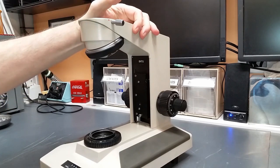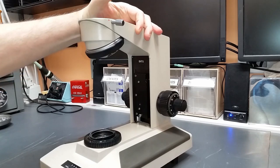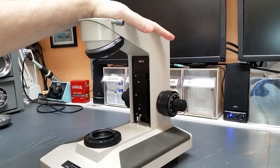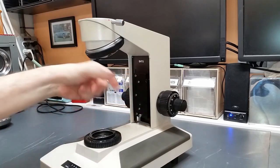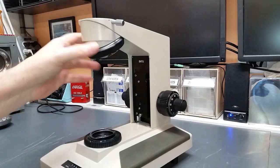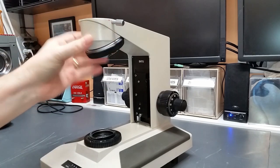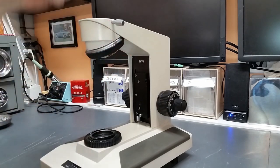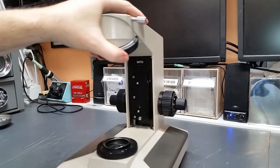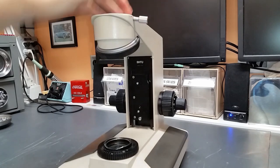Hello, and welcome back to my series on servicing an Olympus BHTU microscope. If you've been following along in the previous parts, you'll know this is a scope I bought on eBay that was badly in need of service. In part one we worked on the focus block, part two the coaxial focus mechanism. Today in part three I'll be taking off the nosepiece turret assembly, servicing that, putting it back on. I'll also be giving the thumbscrew for the viewing head some attention because that's pretty stiff as well. So let's get started.